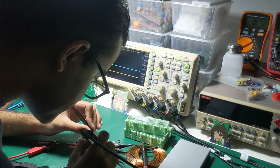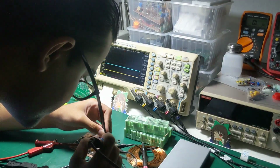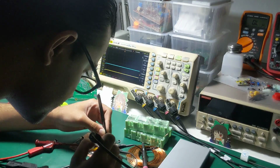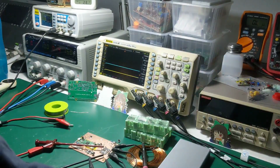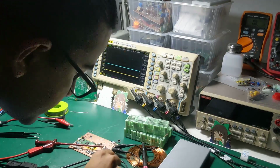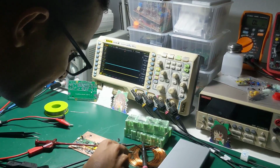Also, can you explain the operating principle and how you came up with that? Do you know how CMOS works? Yes. I've tried replacing it with transistors, they exploded. I'm like, why? I see, oh, two diodes. I'm like, how about I separate them? Fine, but I need to drive them rail to rail so they don't shoot through. How do I do it? Oh, rule of 10, there you go. Oh, they're slow, I added caps, that's it. Okay, that is crackhead engineering though. At least he followed a step-by-step procedure.